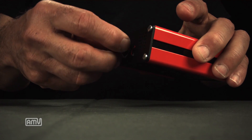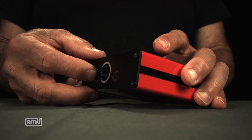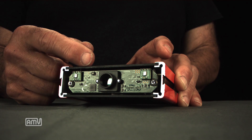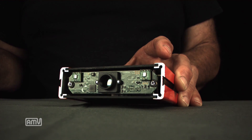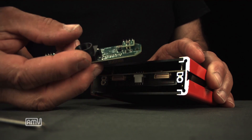Now we're going to take this thing apart. First we're going to remove the lens screws and then remove the four screws that hold the front plate on. With the screws removed, the front plate comes off and inside you'll see the camera board. The camera board has the two microphones on either side, the indicator LED, the lens holder, and image sensor. There are also two screws that hold the camera board in place. Once those screws are removed you can remove the camera board, and this is replaceable so that you can swap out different image sensors.